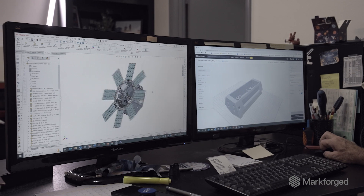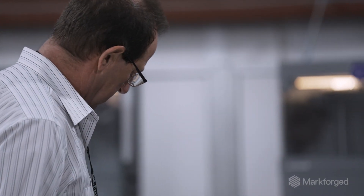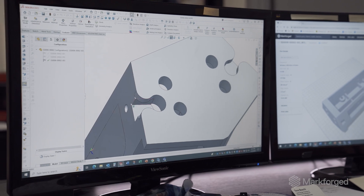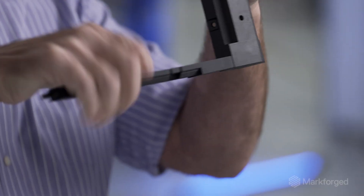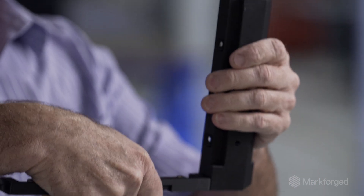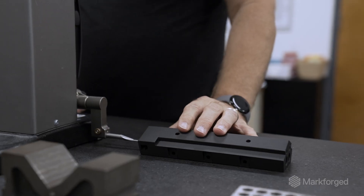It's not only making the parts so they're able to print — it's also making the parts so I'm using the least amount of material while still passing analyticals. Not a lot of people think about how much a screw weighs, and if I could remove those screws from the assembly and somehow rapid prototype a fastening feature, I'd take that weight out. This part right here falls into the slot and then locks into place, and when it's bolted in it's not going anywhere no matter what you try. This keeps our entire satellite structure together — you can't pull it apart because the design on the inside is so precise. If it was off by a few thousandths of an inch, it would easily come apart.